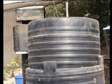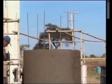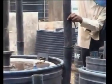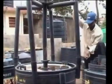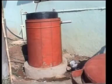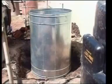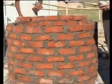The gas holder often tilts to one side, but this can be prevented by providing appropriate supports in the form of bamboo poles, iron rods, or a guard fabricated using pipes. The fermenter tank can be made from galvanized iron sheet of 24 to 26 gauge thickness. One can also fabricate the fermenter with the help of bricks and cement.